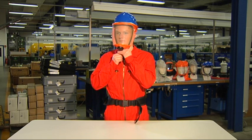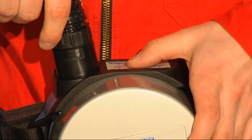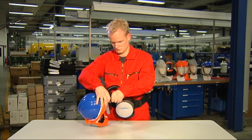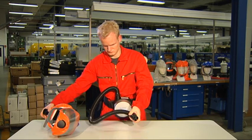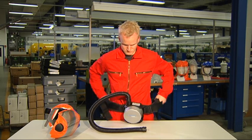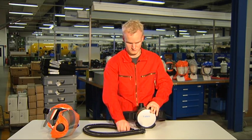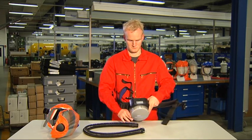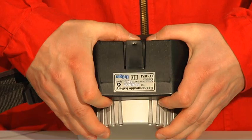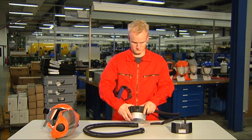Always leave your workplace before removing the unit. Remove the helmet and switch off the unit. Detach the respiratory hose from the helmet. Remove the belt from your waist and then the hose from the unit. Remove the rechargeable battery from the unit by pressing the tab at the center of the battery slightly away from the unit and sliding the battery with both thumbs down and out of the holder.